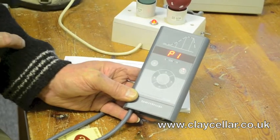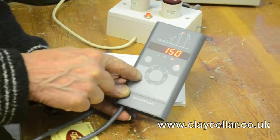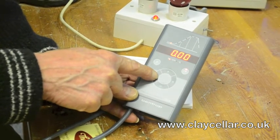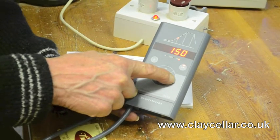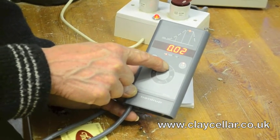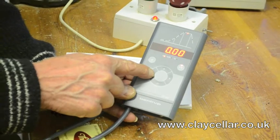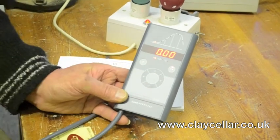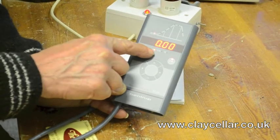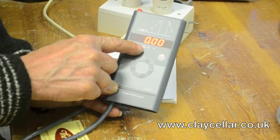P1 I normally put in as a drying program. The controller is operated by single selection of buttons. If you press the 9 o'clock button it will move the program to the left; if you press the 3 o'clock it will move the program to the right. At each section you can change the setting by pressing plus up and minus down. The first option gives you a delay time before it starts. Three little lights beneath the main display show the unit — this is showing 'h' for hours, so this is a time.